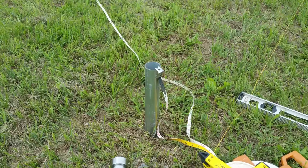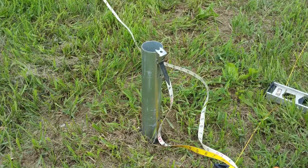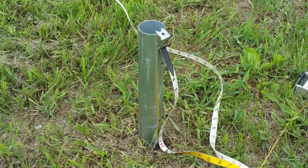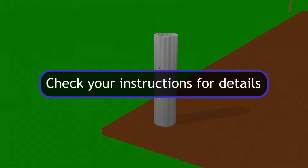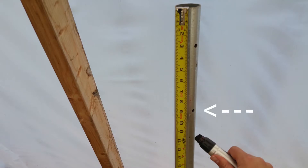Let's begin with the collars. First, you need to decide on the height of the collar coming out of the ground. We use a measurement of approximately 12 inches. Check your tunnel instructions for the preferred height. From the top of the collar, measure that size and mark it — make sure the measurement falls below the lowest side hole. Insert a protective cap into the top of the collar and position the collar at one corner of the squared tunnel. Using a magnetic level and a sledgehammer or post pounder, drive the collar into the ground to the measured mark.